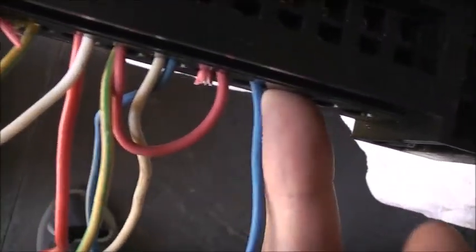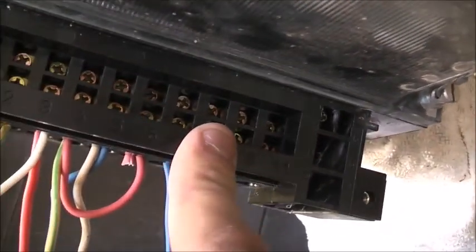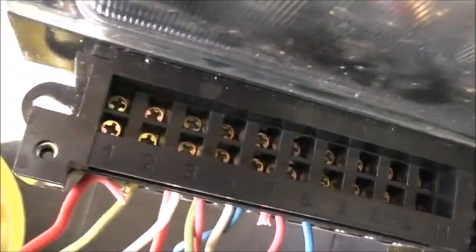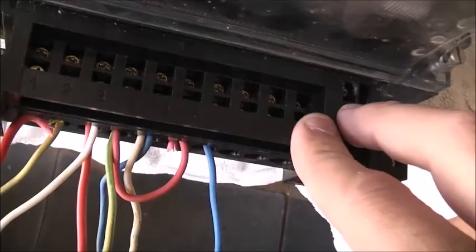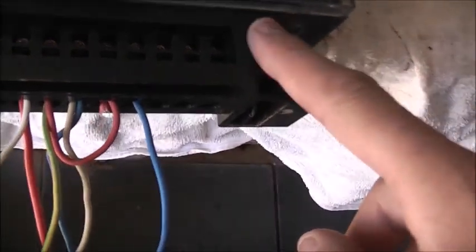I think I got it right on this one. There's a couple of extras here. We've got a potential here which I think might be... that potential's not livened up. I've only got two of the potential cores livened up, and there's two here. That's just what runs the rate changer - between that one and the neutral is what runs the rate changer.